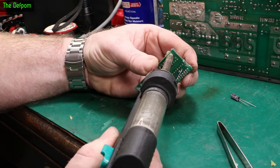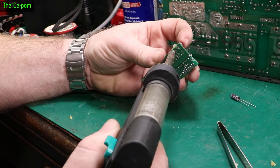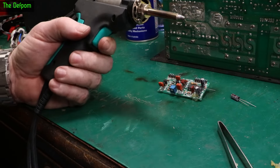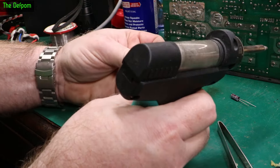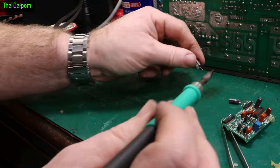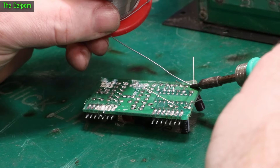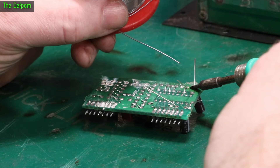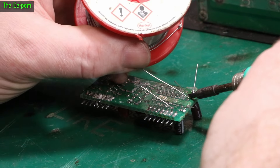I've already taken one cap out and put the new one in. I'm just going to take this one out — the 3.3 microfarad, both 50-volt rated. The glue is in the way and this one's going to be awkward. Because it's got a ground plane on it, the first one soldered beautifully, this one's being a pain. Got that one out. New ones installed, soldered in. The ground plane here is always going to be a pain — got to get it soaked through as it's a double-sided ground plane.